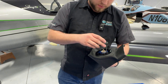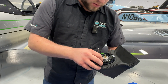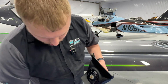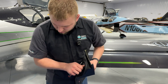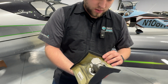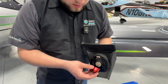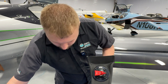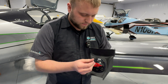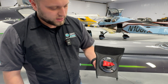From the front side, we're going to take this plate — same drill as before: screw down the corners a little bit, pull the rods, put the other two screws in. Before we put the selector handle on, everything's screwed down and nice and flat. There's a little nylon piece in the bottom there that lines up with the notch carved into the shaft. We'll get that started on there, get the two and a half millimeter hex wrench, and screw it down until it stops. Then we'll check the function and make sure it locks when it's supposed to — and that's the assembly.